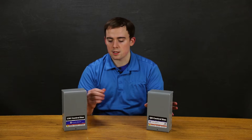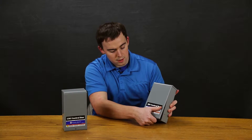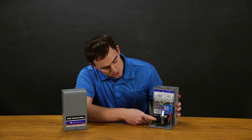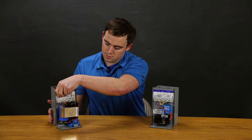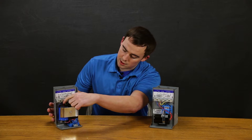You can actually see this here. I'll open up the control boxes. So this is just a standard QD — here you have your start capacitor and your relay. And in the CRCs we have the relay, start capacitor, and the added run capacitor.